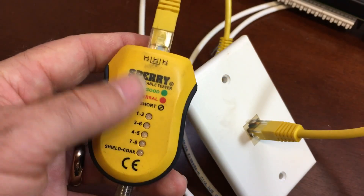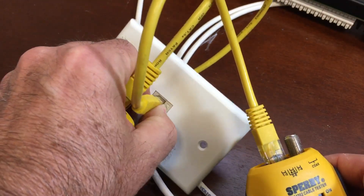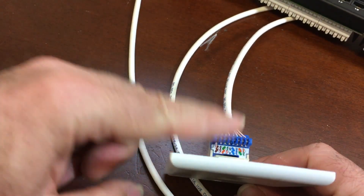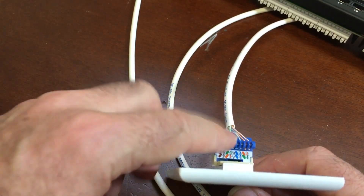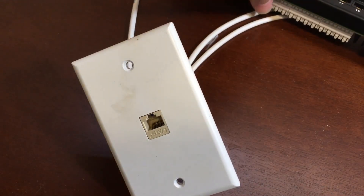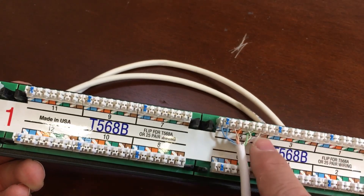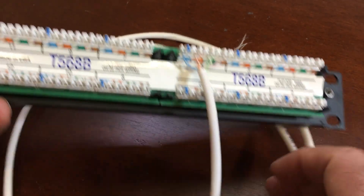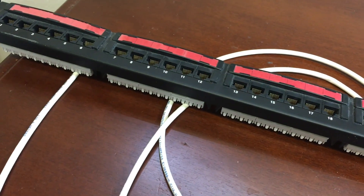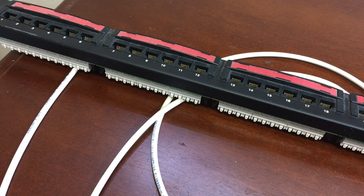If you are a network administrator, this would probably be a good investment — spending $10 to $30 to get one of these to test out cables. In general, cables usually don't go bad on their own. After 20 years in the field, the most common things I see are: water dripping down a wall onto a jack, eventually causing it to corrode; stress on adjacent cables when new network additions are made at a patch panel, causing nearby connections to come undone; and lastly, pretty rare, brute trauma like a cable cut or somebody damaging the cable while it's in transit between the wall jack and the patch panel. I hope that helps you out — please feel free to leave comments, I'd love to hear from you. Thanks for watching.